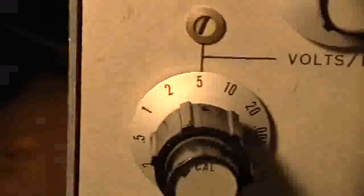The A channel is the battery, or the positive rail where it goes into the board. Sorry about the light. And we're viewing it at 50 volts per division, 10x attenuated probe, remember. And the B channel, its baseline is that graticule marker right there. Let me make sure it's right on it. Right there. The B channel is the current viewing resistor. Okay, so now, let's see, there's the battery voltage, no load, and there's the current on the inline ammeter.